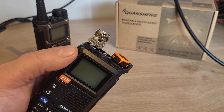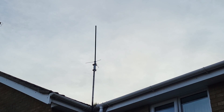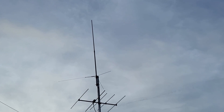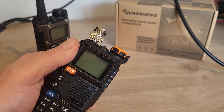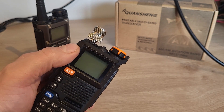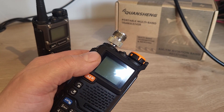Alternatively, if I wanted to listen to something on VHF or UHF, I'd plug into either my Diamond X30 or my V2000, which are mounted high up on the roof of the house. On VHF and UHF, height is the key — VHF and UHF generally, with a few exceptions, travel line of sight, so the higher you can get your antenna the better the reception's going to be, and it really will improve it over the little stock antenna on a handheld like this.